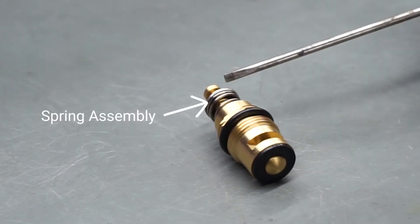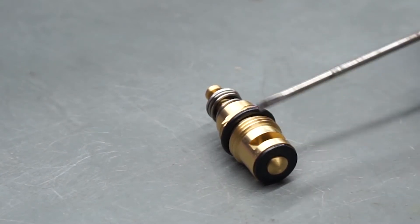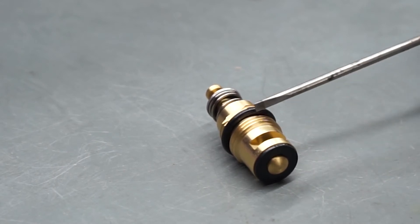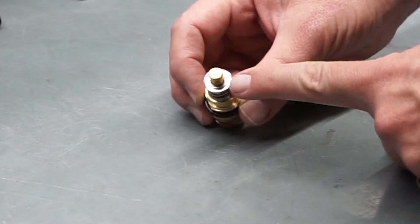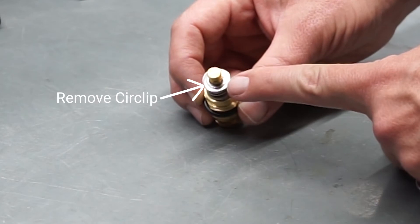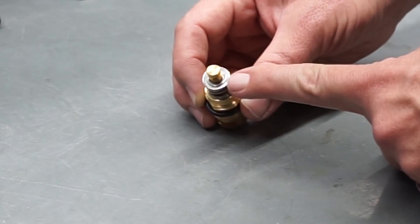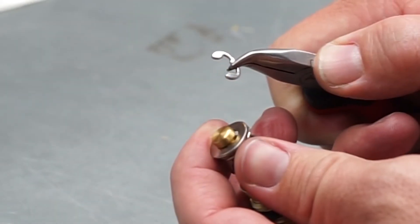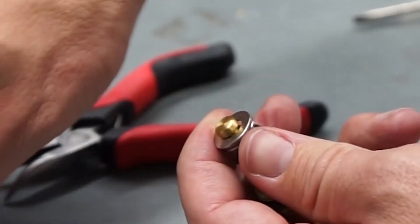What we're going to do is take this spring assembly apart and remove the spindle so that we can grease it, because there's an O-ring on the spindle part just up inside here. We're going to remove this circlip. You need to compress the stainless steel washer and pull off the circlip. We've removed the circlip — keep that off to the side.